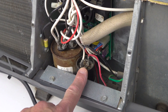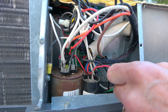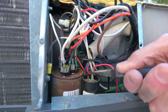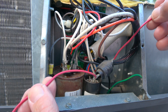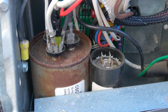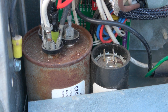Since our AC units are equipped with a start capacitor, the last step in here is to disconnect it. We follow the white wire from the start capacitor over to the run capacitor, remove both ends, and discard the wire. We then follow the red wire from the start capacitor and see that it ends at a connector on the run capacitor's red terminal group — remove both ends of that red wire and discard it. Along the length of that wire, we have a small device called a PTCR, which is part of the start capacitor system and can also be discarded. You can remove the start capacitor if you want to. We're just going to leave ours because the strap that holds it in place is a little hard to unscrew, and since it also holds the run capacitor in place, it's easier to just leave it there rather than resizing the strap.